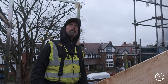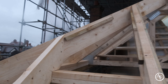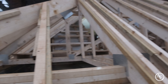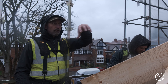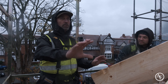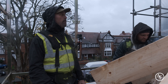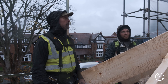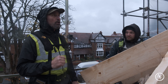That's a really, really good day today. You can see the weather - we've been fighting against it. Me, Pete, Al, we've done all of the infilling, doing the relevant jacks. They're all in now. We've done all the infilling on the other side. We've just got a box gutter to do where the chimney stack is. Just got to get that done tomorrow. And then we can get all the soffit and fascia timber work in, ready for the actual soffit and fascia. So hopefully by Wednesday night we're actually going to be watertight, which is really cool. Originally on the plan it was going to be Friday, so we're going to be a couple of days ahead, which is a big plus.